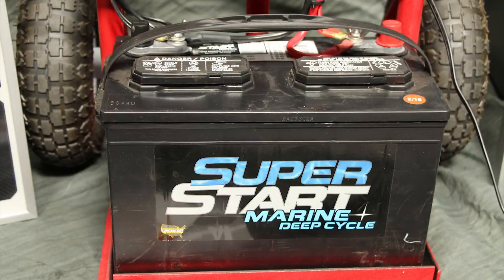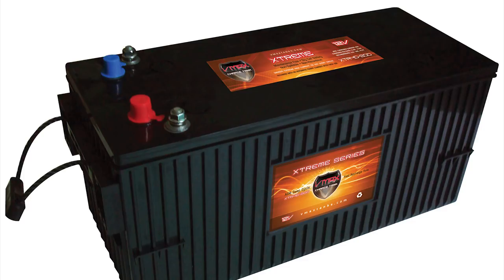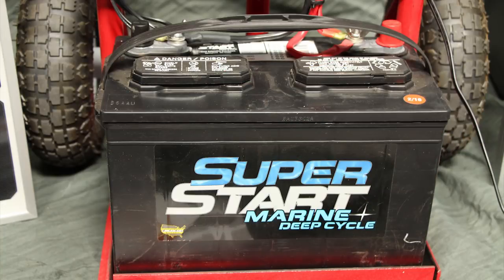After considering the comments, I did a lot of homework on battery selection. A sealed AGM type battery could provide more power storage and could be used on its side, allowing me to stack two or more batteries in the same small footprint. The downside of AGM batteries is that they're both heavy and expensive — matching the capacity of the battery I selected would make the unit heavier, and the battery would be around three times the price. I stuck with the original battery, as it's nearly the best kind available that fits my design goals. Another benefit of the marine battery is that with regular jumper cables connected to the battery posts, I can add power to the system from an additional car battery.